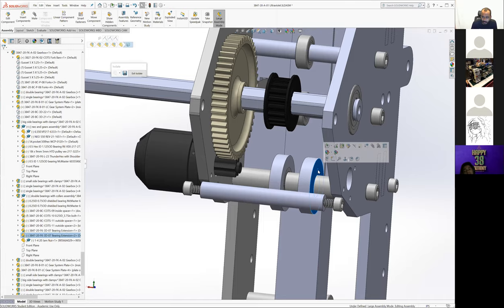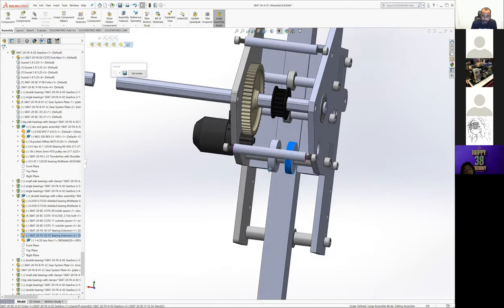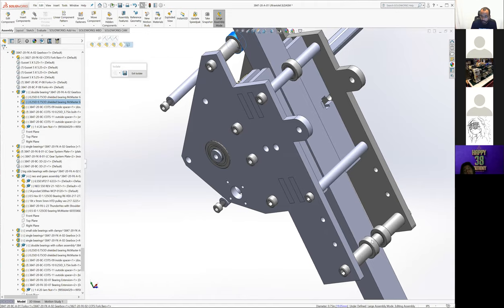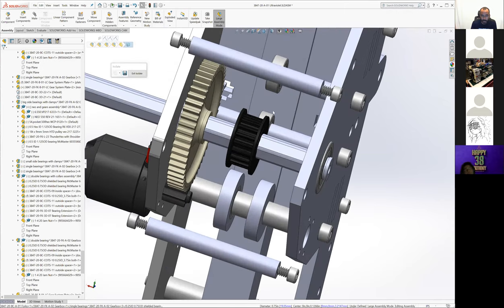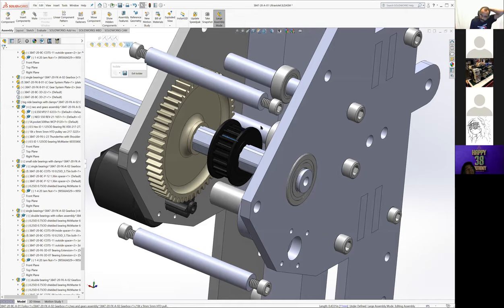We had to make this a bigger OD when we were running. So the belt would go along this, between these two. These bearings it's riding on, and these bearings here, in addition to the back bearings, are what the rails are actually sliding on. Then the belt comes up over this pulley, or this bearing that's acting like a pulley to redirect motion, and all the way around the actual timing belt pulley, which is the only one engaging the teeth, and then back under here. This gets a nice big amount of wrap on the timing belt, so it's engaging lots of teeth.